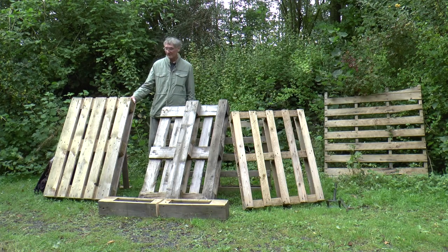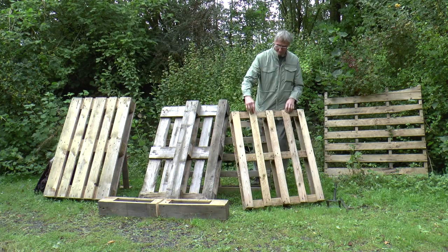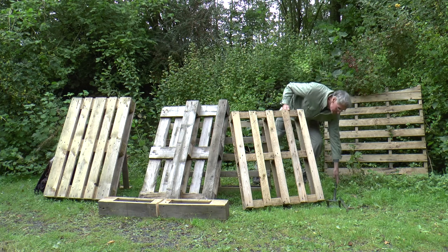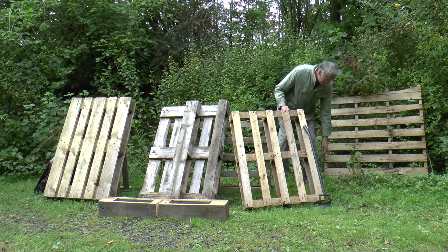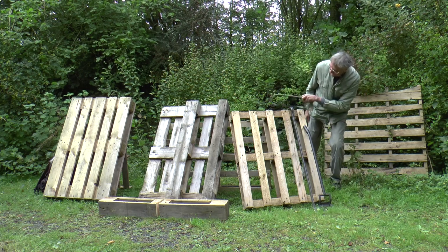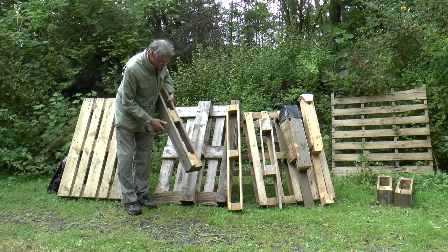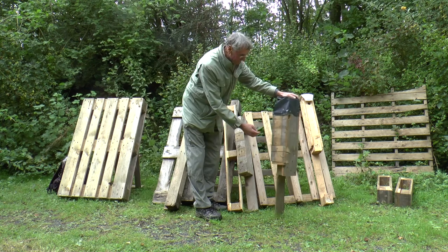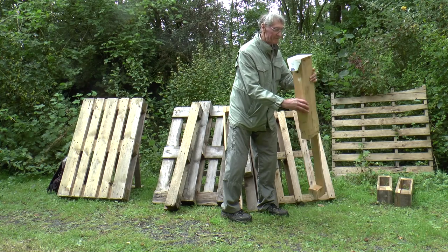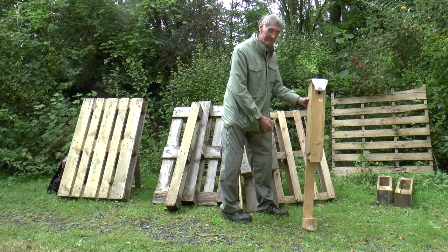Pallets are a great source of wood for making nest boxes. These are typical lightweight pallets. The pallet is dismantled — it's worth trying to remove these two pieces of timber using a pry tool, a big wrecking bar, or even a hacksaw just to cut through the nails. For the nailing board, you cut it here and here and you end up with the part-made box. I've made the hole over the front end of the top. It's very important to have a little bit of a roof on the top, because water can seep in and it can end up being damp and the bird wouldn't use it.